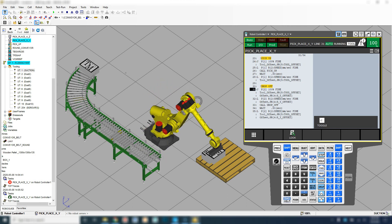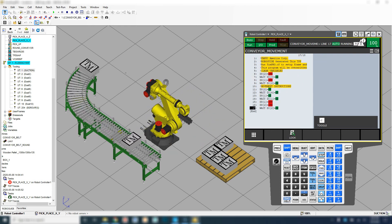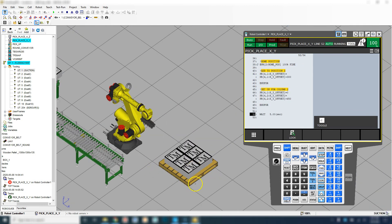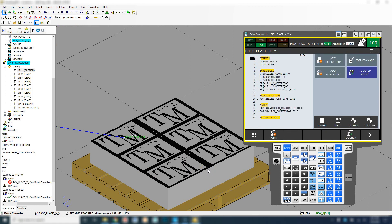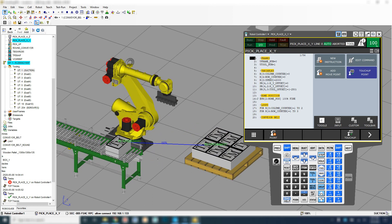So once again, we're going to have to get the timing down. So now we swapped from the Z stack to a stacking for a palletization — that five seconds. Basically the only thing we need to do with the program is get the timing down with our conveyor belt. Our programming works for this. There are a lot of areas we could speed up the process — for one, we can have the robot closer to our pickup before we actually pick up, so it doesn't have to travel from home position. But again, we're just getting the point across of how to pick up and palletize a simple palette. In the next video, we will add a Z component to this, so we'll stack it a couple times as well.